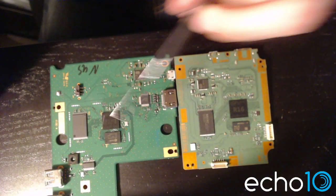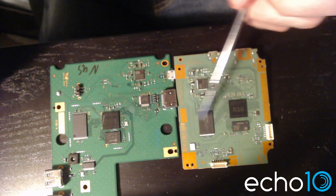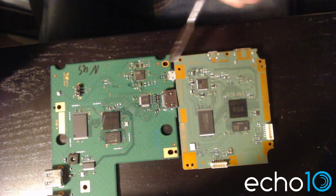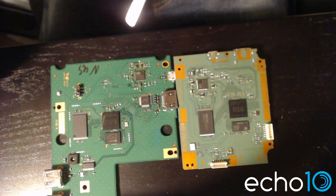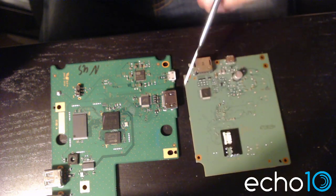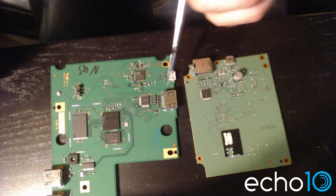Okay, so the R16 is exactly the same size as the Z7213. The RAM is basically in the same location. NAND is basically in the same location. The PMU has been moved and rotated, but ultimately looks like it's about in the same orientation. That's going to obviously live close to the micro USB port. I believe it uses the same chip to do HDMI out, which I think takes the LVDS signal and converts it to HDMI.